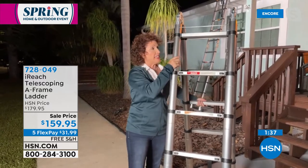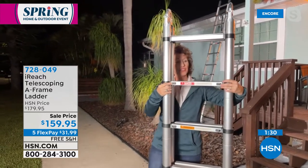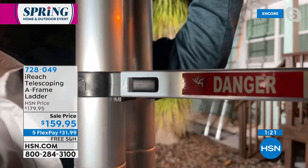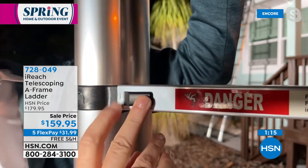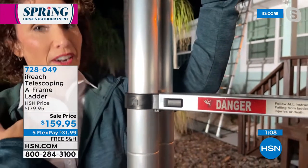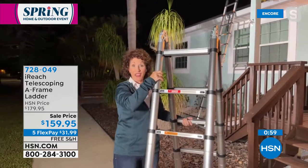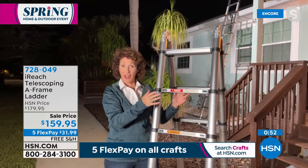When you're done, all you have to do is release these locks on it. Let me show you a little bit about this lock. If this isn't in the right place, notice how that kind of comes in? If it's not locked into place, it'll show me that right on this icon. But when it gets into place and locks, that icon shows me that it's locked. What I do — because I've been on a lot of ladders — is every time I go up on this ladder, I look and make sure that it is locked in place, and you have that.